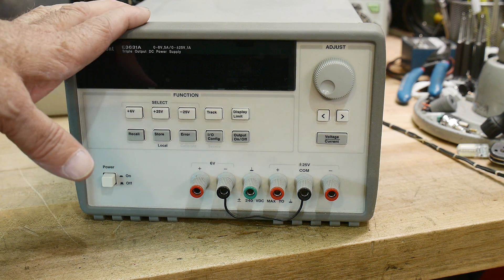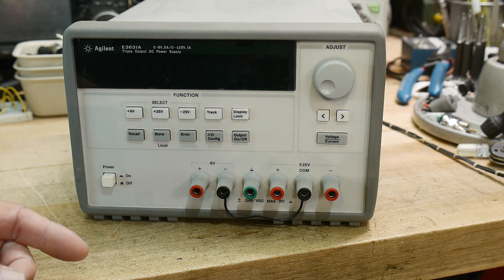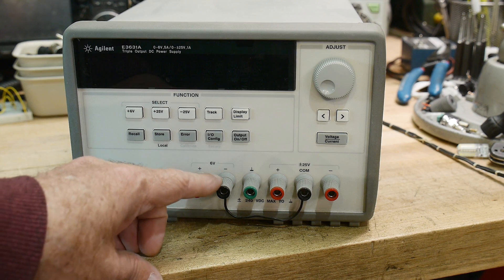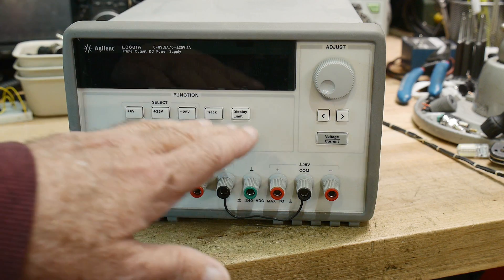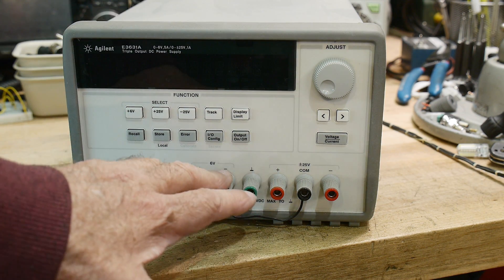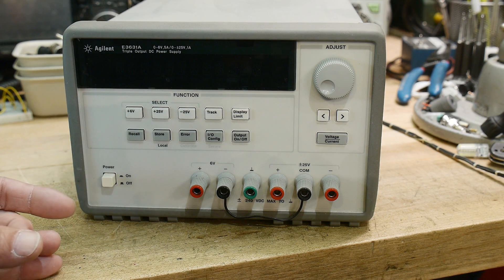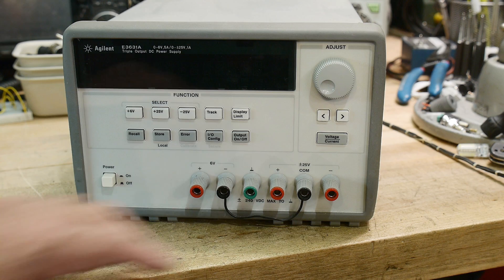It's great over the bus — it's just awesome over the bus. It does have another downfall though. It's a bit different in its output voltages. It can output 6 volts here up to 5 amps, which is great — that one only does 3 amps. And then the plus and minus 25 rails only go up to 1 amp, and a lot of times that's just not enough. So the other one having 3 amps on those rails is going to be really handy.